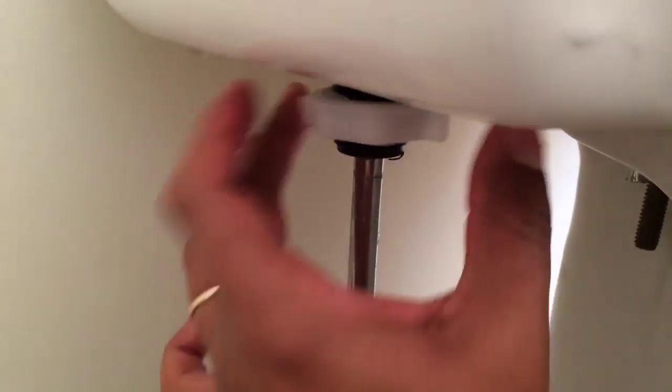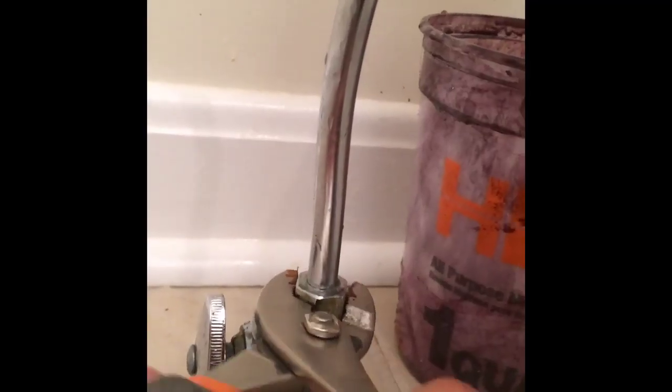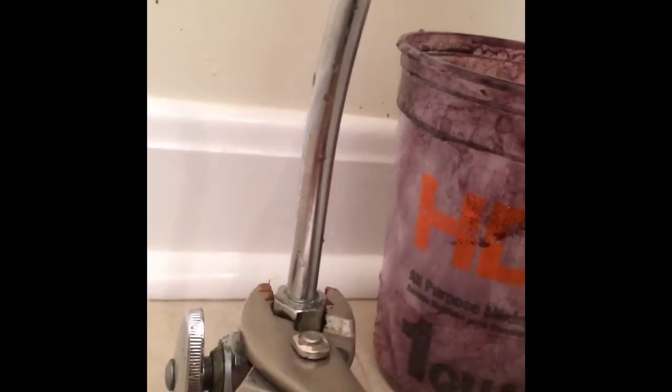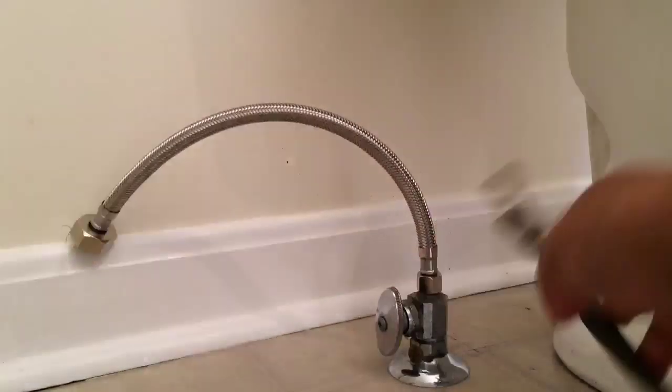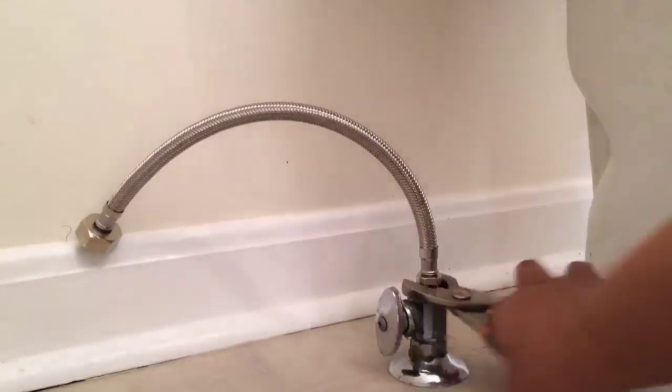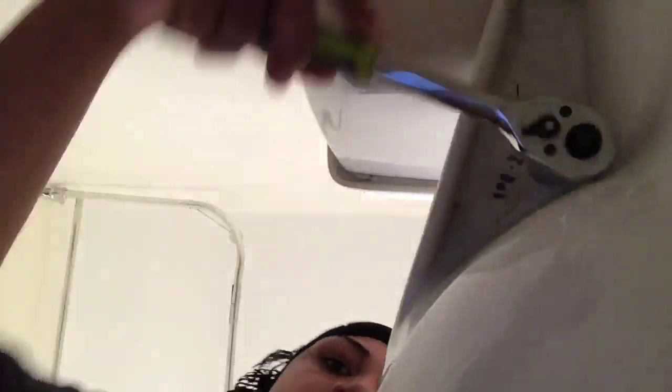The washer that I'm removing now — don't remove that. That keeps the outlet attached to the tank. Undo your supply line; you're about to get a new one. Remove the toilet seat. For this step, you want to reach for your Craftsman ratchet set — that's what you use when you need to loosen things in tight places. Perfect time for a new toilet seat, just saying.